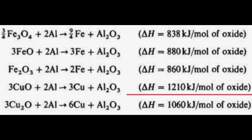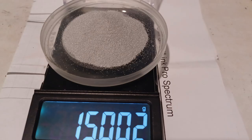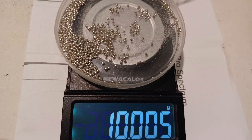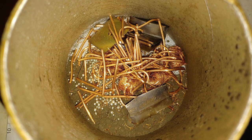But don't worry, I can fix that. The first mixture I tried consisted of 65 grams of copper oxide, 15 grams of 200-micron aluminium, 10 grams of tin granules, and 30 grams of metallic copper. The large particle size of copper oxide and aluminium serves to slow the reaction, and the extra metal in the mix is there to absorb some of the released energy and prevent the copper from boiling.